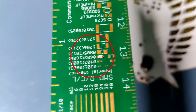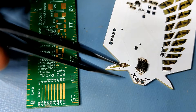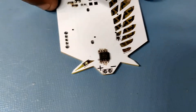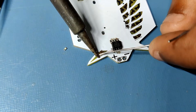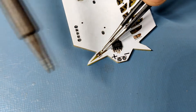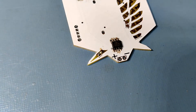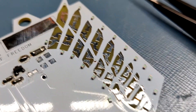As for the LEDs, I will be using 0603 package LEDs — 18 of them. The twist here is that I won't be using these LEDs in their normal orientation. I will be soldering them in an upside-down position so their glow faces the FR4 board, which has a solder mask opening on both sides. This opening will transfer the glow from the back side to the front side. To solder each LED, I first add solder to one side, then pick and place the LED and melt that solder to hold it from one side. Then I add solder to the other pad to secure the LED from both sides. Then we solder the rest of the LEDs one by one following the same method.